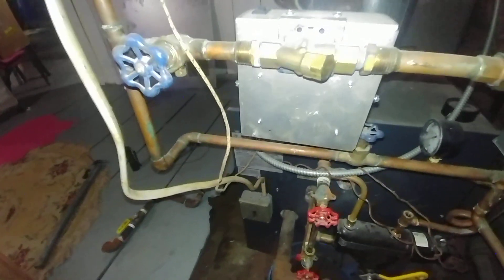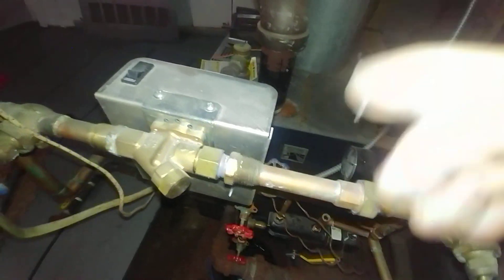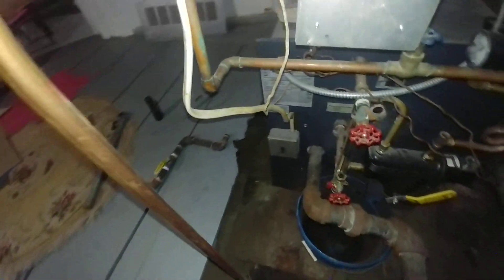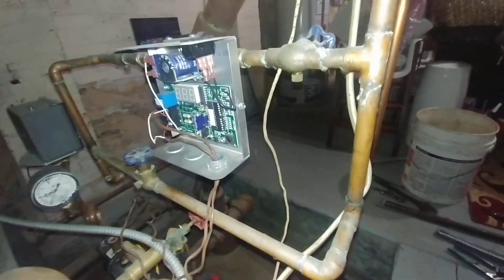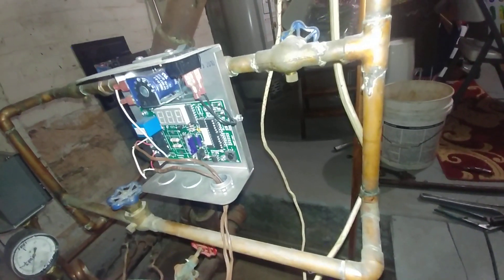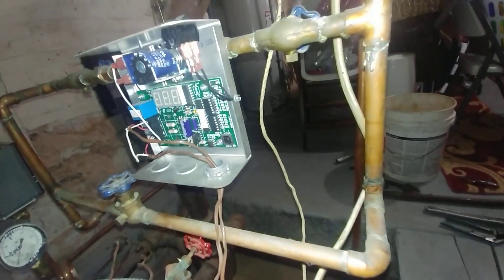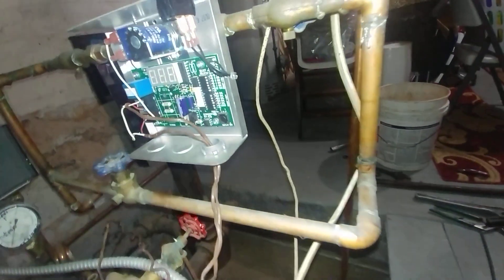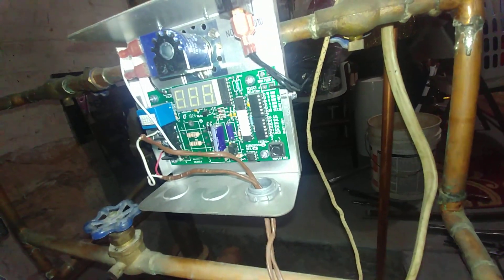The VXT was added by others, probably sometime around 2010. It was probably mismatched to begin with, and they've mounted it so that it's a little less convenient because of the directionality of the solenoid valve in the back. And it seems like folks don't realize that thermostat wire can come in gauges other than two-wire, so they had to add an extra wire to make that work.